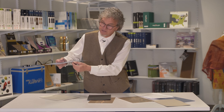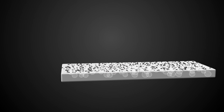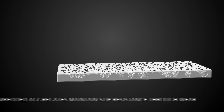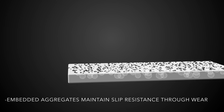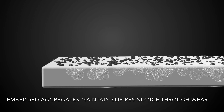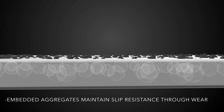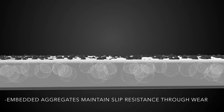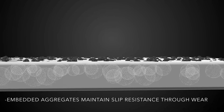However, if you specify a product with sustainable slip resistance, that extends throughout the thickness of the material. In fact, for products made in Europe, one of the test results they have to comply with is to actually wear down the surface of the floor in the lab and then test it for slip resistance again. So they test the new floor and they test it after simulated wear, and it has to pass both times. If you specify the right type of product, the slip resistance will not wear off.